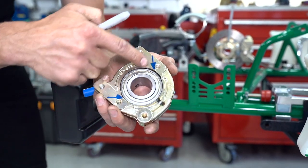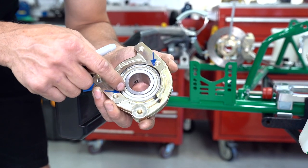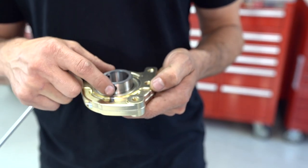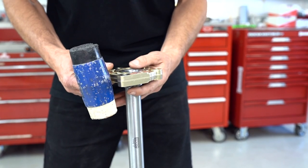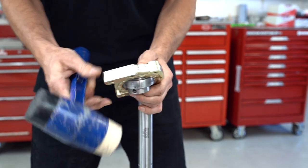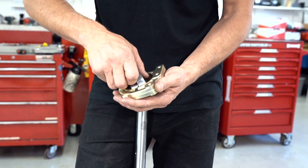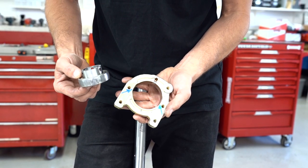You can see here there are a couple of recesses on the bearing cassette, so we're going to rotate the bearing inside the housing and get the spherical part of the bearing into these grooves, then we can remove the bearing straight out of the cassette. First, loosen off the retaining screw — this acts as a little clamp so that once you've got the bearing in its final position you can do it up and it stops it from moving. Reinstall the bearing on the axle and with the soft hammer you can just tap the bearing around. Rotate the bearing to 90 degrees and spin it inside the cassette — there's a spherical edge on the bearing and the same inside the bearing housing. If you flip the bearing over, you can see where we marked it earlier — that's the in and out hole.